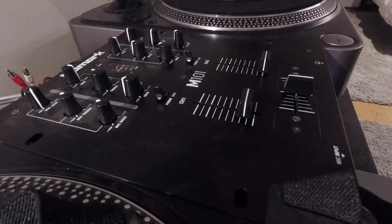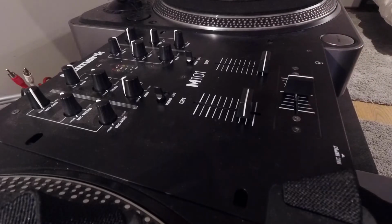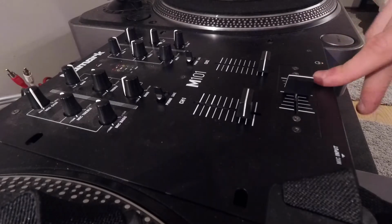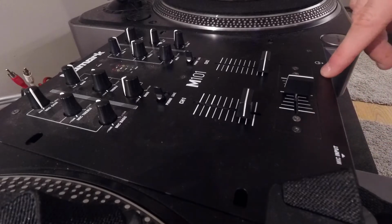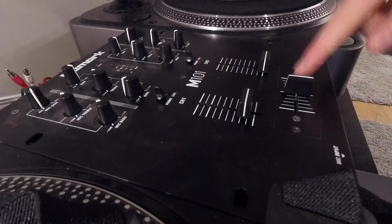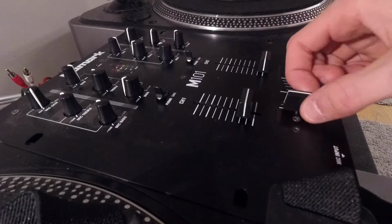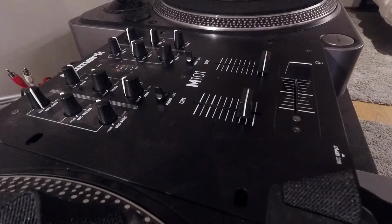The difference between this mixer and some other mixers is that some of the newer ones, maybe like some of the Serato ones, are digital. So in the crossfader there's like a small computer, I think, that's just saying, put 100% of channel 2, 0% of channel 1, or maybe 50-50 or whatever. This is actually to do with resistance and how much metal is being touched. So it does get dirty through this gap, and bits of the metal flick off. When you're moving it, it ends up giving you some channel bleed on each side because the contacts aren't touching as well.